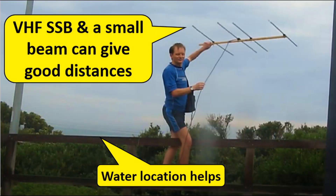Another possibility — this will require a bit more expensive equipment — is VHF and UHF privileges. If you've got an HT, you might only be used to FM, maybe even digital modes for some of the better ones. But SSB is completely different — you can get longer distances, especially if you've got a horizontally polarized antenna. In some areas there are activity sessions, contests, or QSO parties. You could get maybe 200 miles with a quite low power SSB setup on a band like 2 metres. And don't forget 6 metres or 50 MHz — with the solar count going up, there's a possibility of DX.